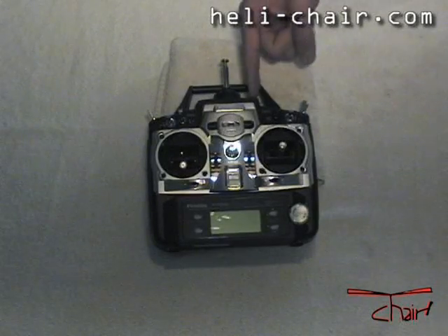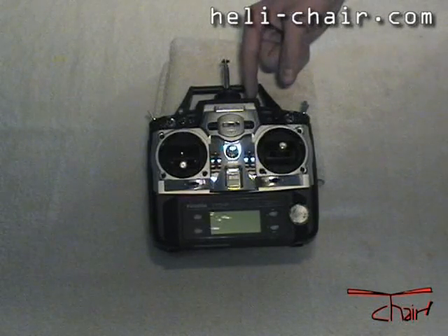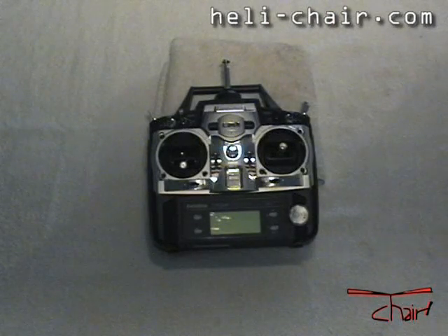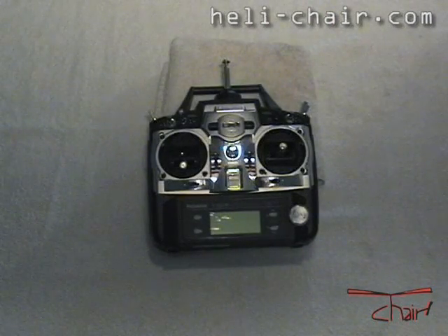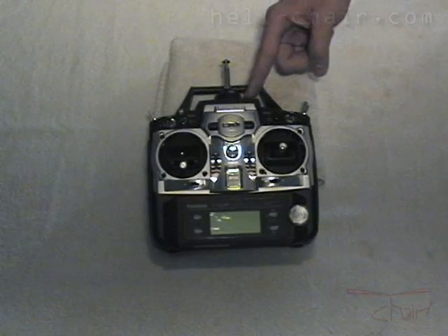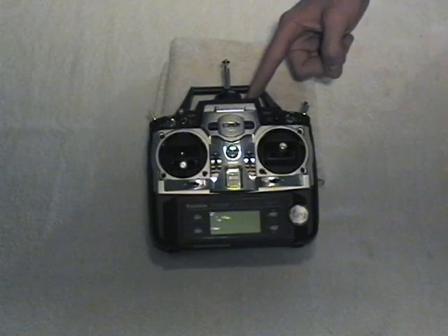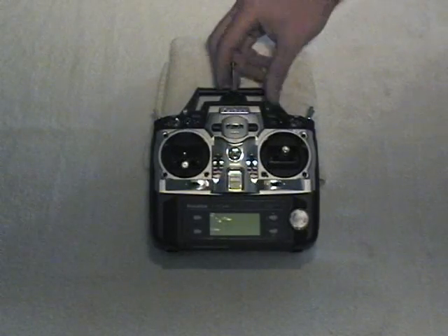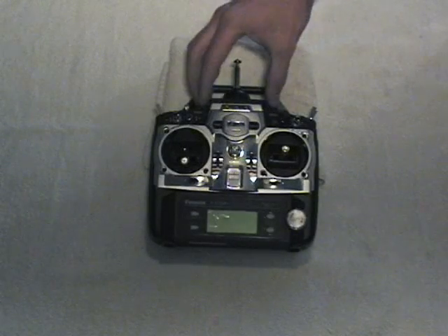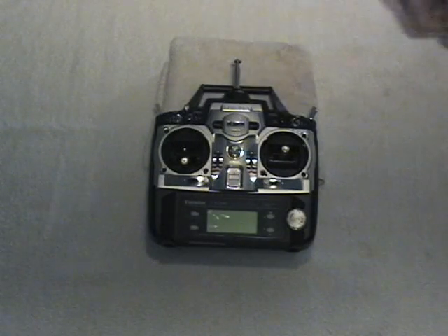It's important when you drill: don't drill any deeper than about one inch, and use of a drill stop is recommended so that you don't go too deep. You can drill these before taking the radio apart if you know what it looks like inside, because we know how far we can go and where to drill, or you can do it when the radio is disassembled.